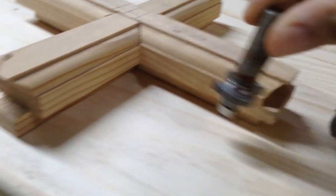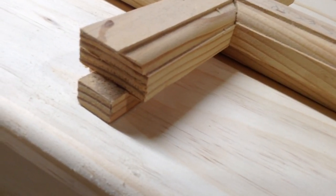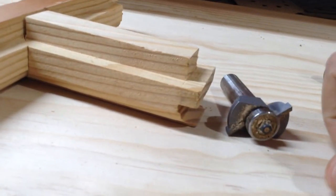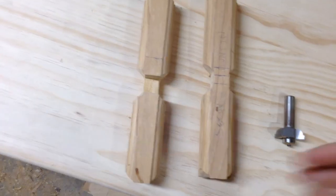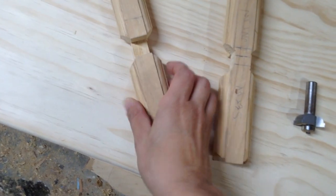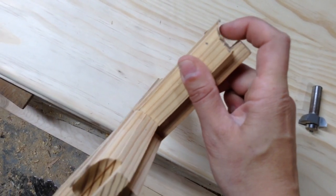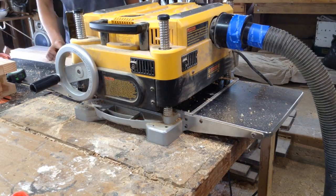This gives you an idea of the bits needed to make windows the proper way: a bit that creates the molding, a bit to create the concave mirror image on the side so it fits together, and a bit for rabbeting on the back. This is just a visual of the joint needed for the laps — it's more involved, and you also have to mortise and tenon all of the mullions into the frame, making it a much more involved process.